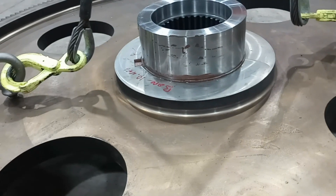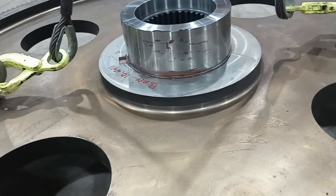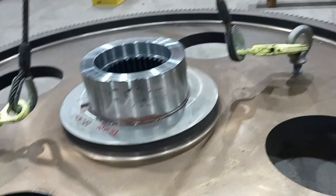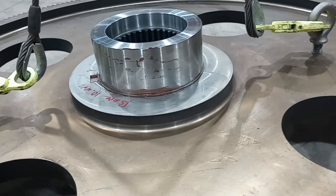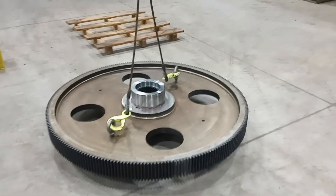You're trying to get that thing as dead nuts on as you can — one shot. But sometimes, if the key was a little taller than you thought it was, or it gets a little cock-eyed, they don't go, and then you've got to quickly pick it up. That'll be stuck in there — slam that steel block on it, go to wailing on it, get her busted loose before she shrinks on. Because if it shrinks on wrong or half on, you are really screwed. Anyway, that's the kind of stuff I've been up to for the last couple months. Just thought you guys might get a kick out of that.